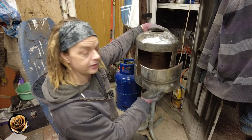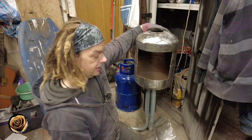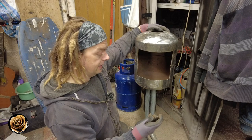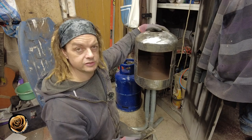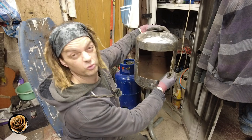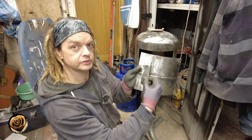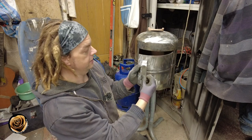The gas canister body will be welded onto the legs once I get it straight. From the front I've cut out a door — a nice big door. I'm going to drill a couple of ventilation holes in the front for when it's closed so it keeps burning. I've used a brass hinge; I don't think it'll exceed 800 degrees on the outside, and steel hinges rust up and seize after getting hot and wet. The plan is to weld through the brass holes to fix it in place. The handle came from the original carrier handles on the canister — chopped off and repurposed.